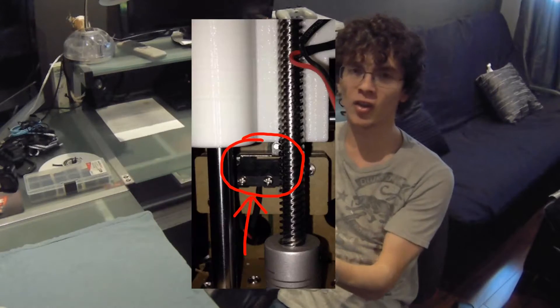Step 2: find the thickness of your glass. This one is 3mm thick. So on my printer I will increase the Z-axis stopper 3mm higher. That way, on the next print when I select the option to home all, the extruder will go down and will not crush into the glass, because we increased the height 3mm on the Z-axis stopper.